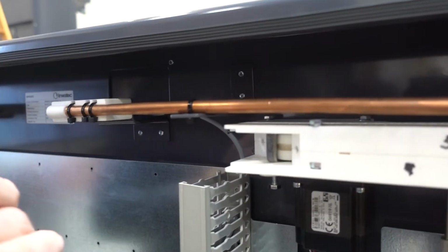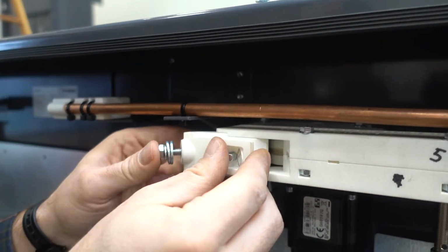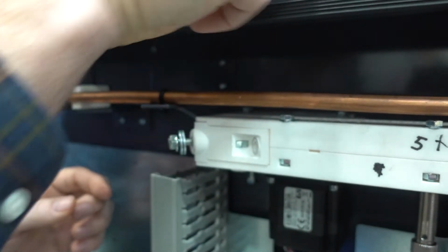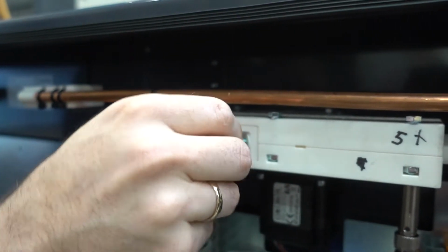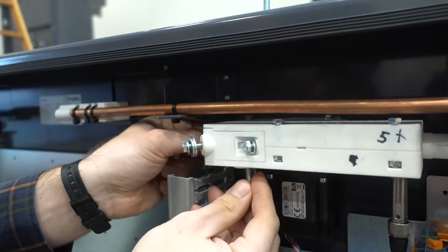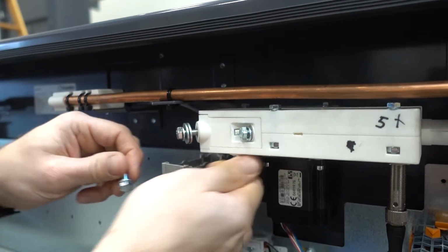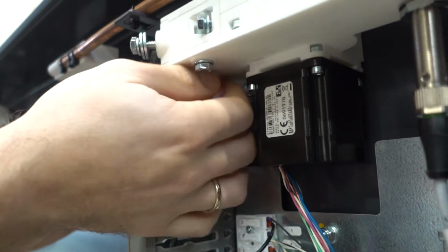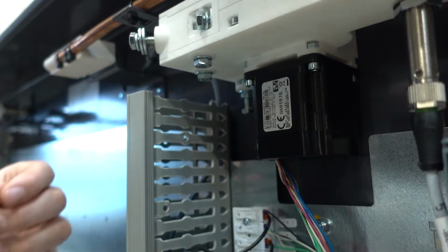and we see that the spring is intact. And we slide this one in there. So we put the bolts in again. And we'll make sure to tighten them all, not very tight, approximately 10 Newton meter.